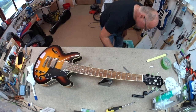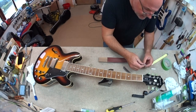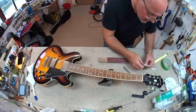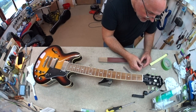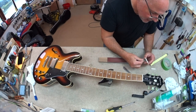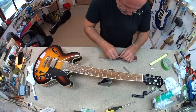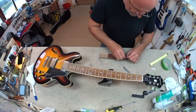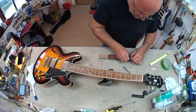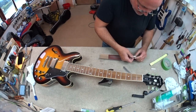So what I'm going to do first is use some sandpaper to flatten off the feet on these nuts. The little grub screws sit through, poke through, and they're what are they called? Cup type. Yeah, cup type. So they're not massively pointy and sharp, but they're still pointier than I'd like them to be. My aim to begin with is just to flatten them down, and I do it with old side to side rocking motions. I like to sand them down until they're flattened out,